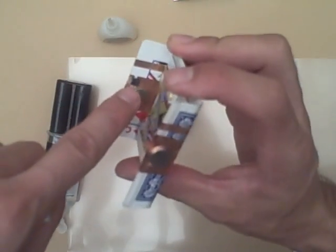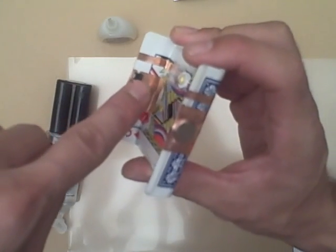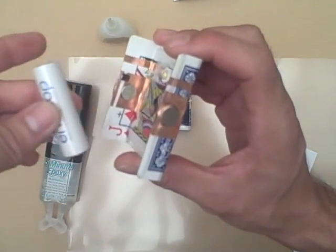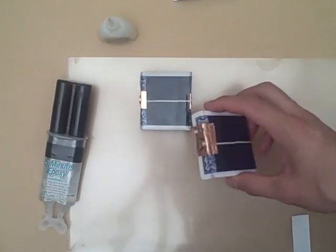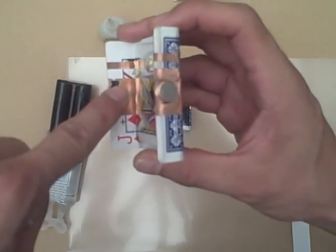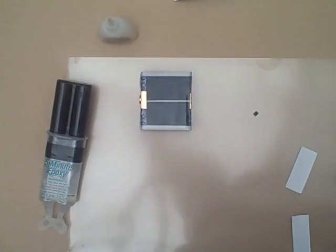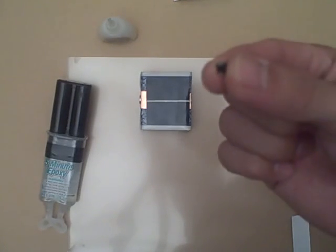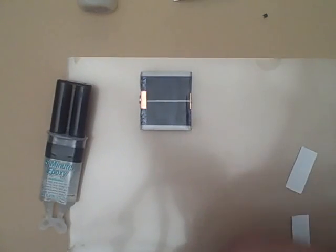Now if you want to get a little fancier, you can add indicator LEDs on the base of your card. Something that's quite essential, actually, is you can add a Schottky diode — a low-voltage drop diode — in between your solar panel and the battery you're going to be charging. This is important if you're going to leave your batteries connected into your charger at night, to prevent the battery discharging into the solar panel. I like to use surface-mount Schottky diodes because those can actually be mounted with super glue, if you're careful.